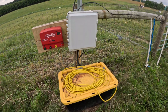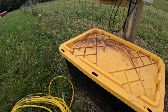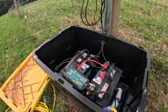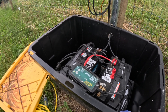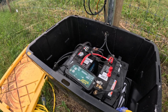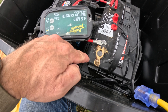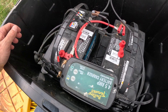I've got my control box here and my batteries down here. You'll notice I have an extension cord on here because in the winter months, or if we get a lot of cloud cover, I have to run a trickle charger on these batteries. I was doing a little bit of seat-of-the-pants engineering here, and I wanted to see how it worked. At some point I'm going to need to add more battery capacity or add a larger solar panel so that we charge faster. But this works really well — I'd say eight or nine months out of the year I don't ever have to plug in the trickle charger. So I consider that a win. As far as the batteries, I've got two 100 amp-hour batteries in parallel, with battery interlink cables from O'Reilly Auto Parts. It all works out well.